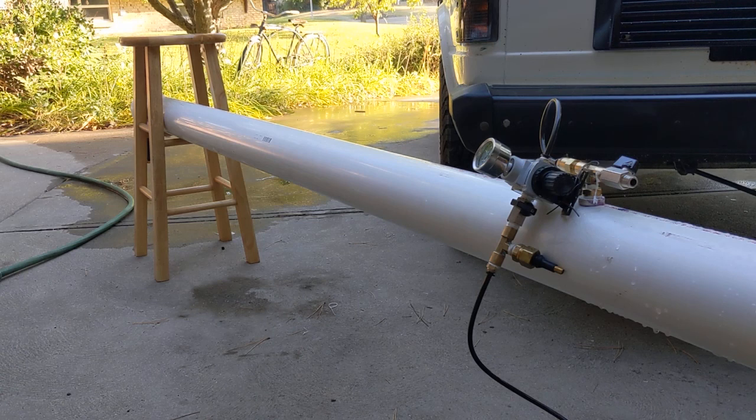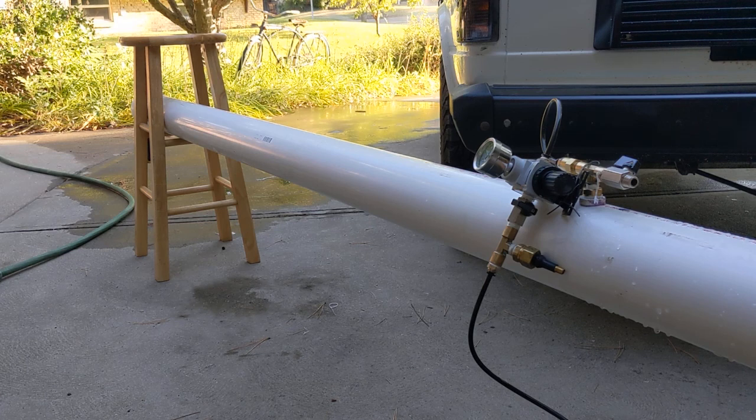The chances of me filling up and charging the pipe via a Schrader valve, getting to a campsite and it still having air in it, was kind of a crapshoot. So I decided to think about the water system and the air pressurization as two different systems, and then everything started to make sense. The second thing I decided was: no T. This is a 10-foot pipe with two end caps, a hole for the spigot at one end. I don't need to put a Schrader valve in the pipe — that's crazy inefficient anyway.